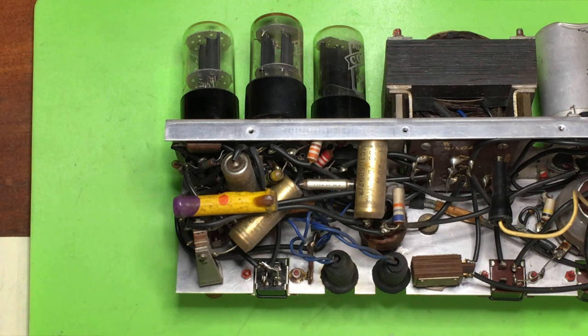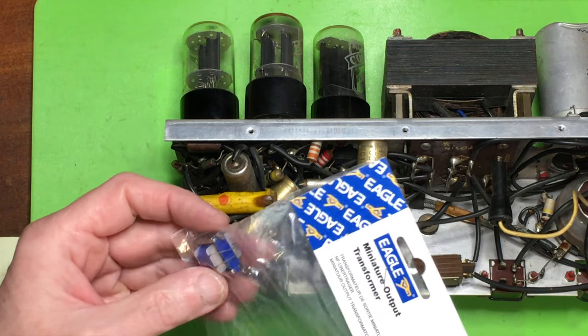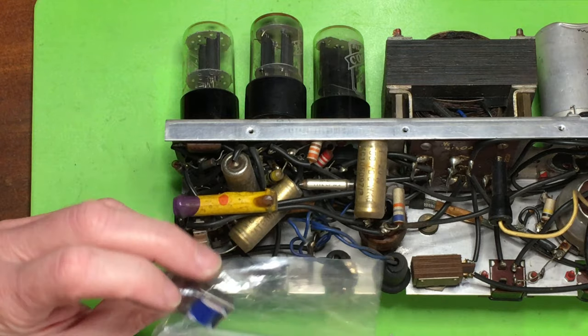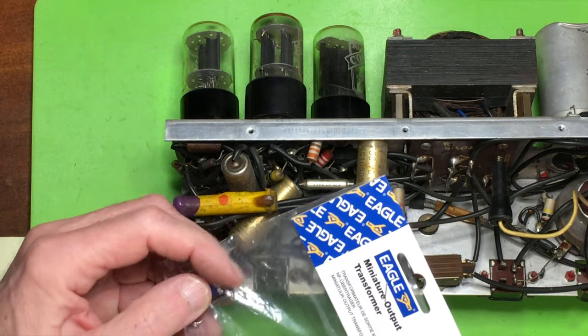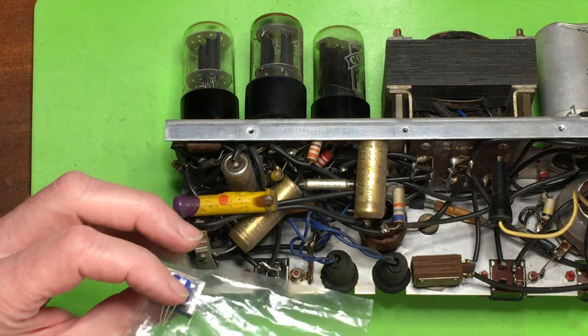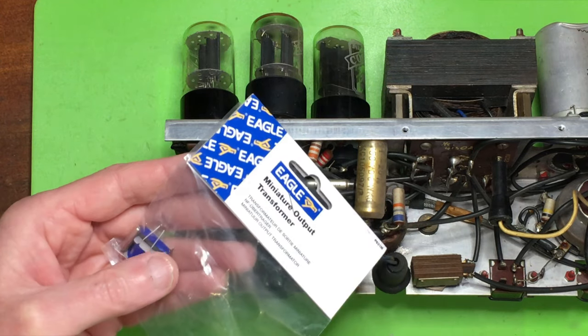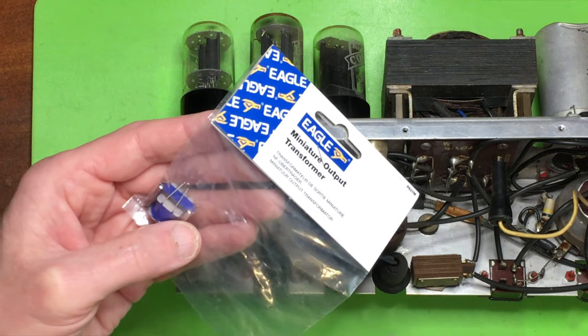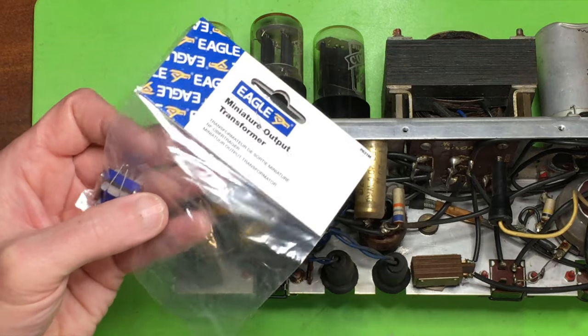So, in the meantime, for the box for testing, I bought a couple of little transformers, which are 1K plus 1K at one side to 20k at the other side. That's a 20-to-1 ratio, so that should give a rather better impedance match using normal headphones than connecting them direct. Yeah, I think my headphones are about 30 ohms.